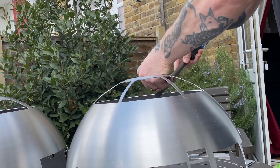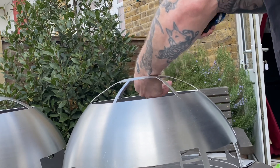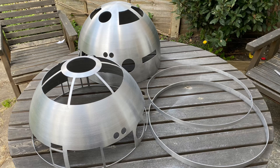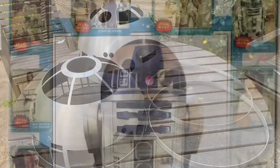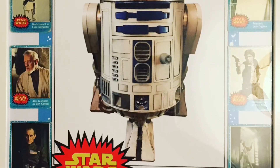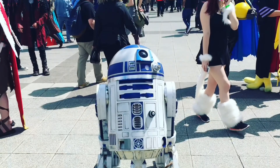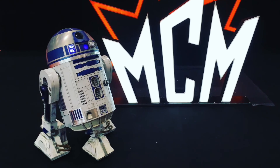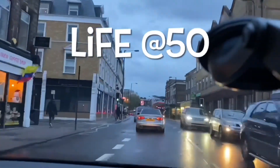File down everything and you will end up with an inner dome and an outer dome. The bottom rings also need to be cut off and filed down — you can see the bottom ring and the blue ring there. Make sure you mark up which is which. The dome is now ready to paint and ready to drill holes for hinges and HPs, which you drill on the inner dome — the outer dome then hides those. Countersink the bolts, and the captive screws if you're using those. I hope this was informative and enjoyable. Part two is coming as we continue to build the dome.